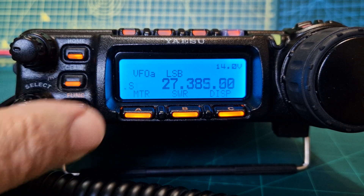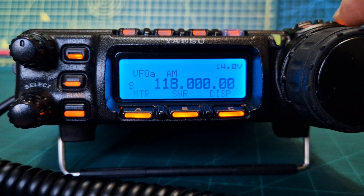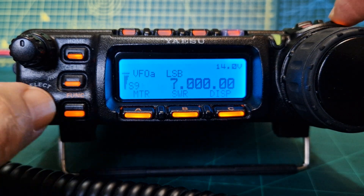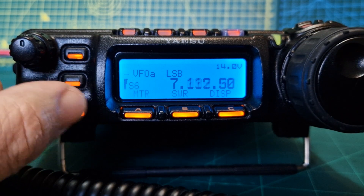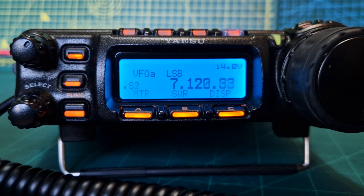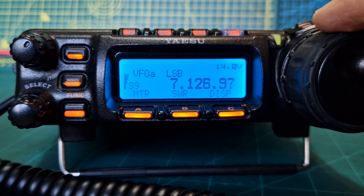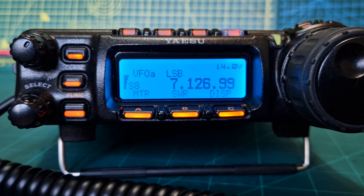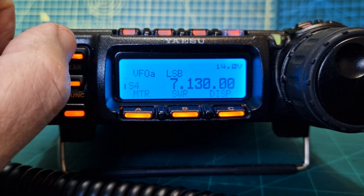That's HF PL259 — it's a 9 to 1 balun and I'm pretty sure it's a 20 meter wire. Let's get that on there and get some power. Right, power's on — let's fire this thing up. Straight away blue screen, volume. Let's go to 40 meters, my favorite band easily. Yeah looking good. I'll put a screen protector on it because I always do that first.